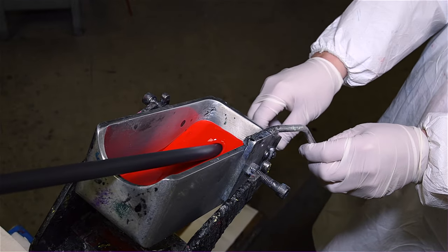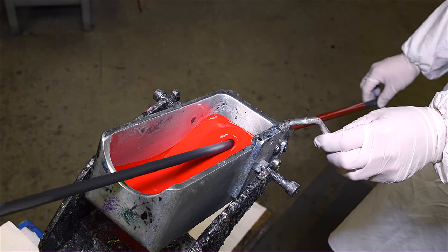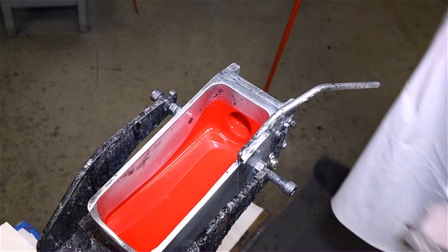This is the paint process. What we do here is make a pool of paint against a rubber diaphragm we call a squeegee. The shaft is slowly pulled through a hole, leaving a very thin layer of paint on the shaft.